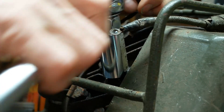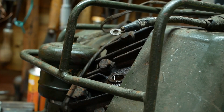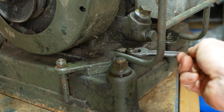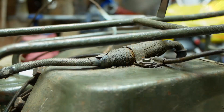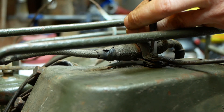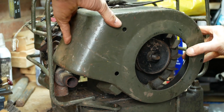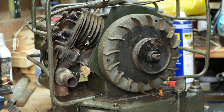At the point I got the plug out, you'll hear my discovery of just how rusty it was inside the combustion chamber. So time to remove the outer frame and the fan cowling to allow a bit better access to the engine itself. The engine still has its original braided spark plug lead and choke cable, both of which are clipped down to the fan cowling, so these will need to be detached before you can progress any further. The fan cowling seems to be in pretty good condition, so nothing more than a quick cleanup required there.